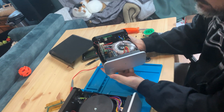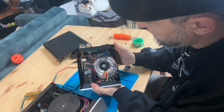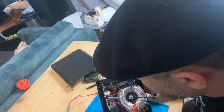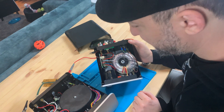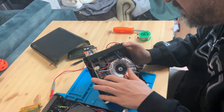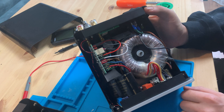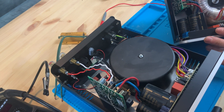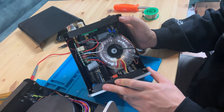Moving over to the 200-watt version — I'll post the stats and model numbers in the description. This is pretty much the same design but with a slightly smaller transformer; it looks like it uses smaller-gauge wire, which is probably why it makes less power. The boards look almost identical to each other otherwise — very close, though not exactly the same. I'm actually surprised by how few components are in this and how good it sounds.